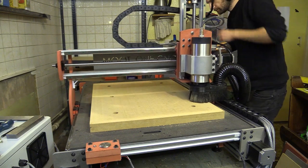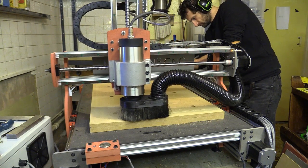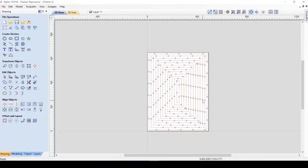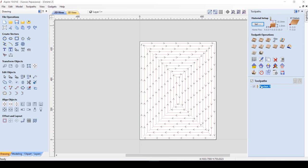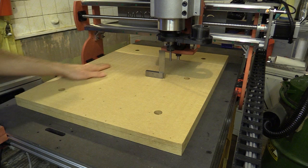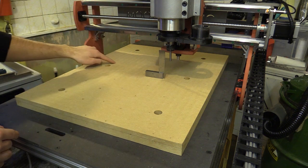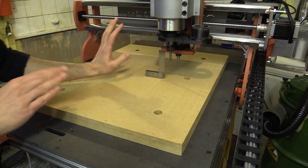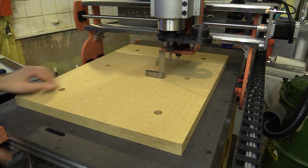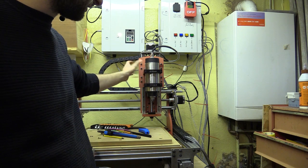I'm really happy with this, and the last thing I need to do is resurface or flatten the wasteboard. I do this with a 22mm two-flute flat bit cutting 0.5mm into the wasteboard. The tool stepover is set to 85%, which is roughly 19mm, and the feed rate is 1800mm a minute. I use a conventional offset toolpath which means the tool spirals and includes movements across and along the wasteboard. The advantage of this method is that if the spindle and its tool are still not entirely square I'll be able to see signs of this on the wasteboard. It's barely noticeable, but if I run my fingers across the wasteboard and look carefully from a particular angle I can tell that the spindle is off by a tiny fraction of a degree counter-clockwise along the X axis, and there's a nod present along the Y at a similar amount. In the manual I'm writing for this machine I use a different spindle mount, which you can see over here — it's not as clunky, and I think it'll be easy to get that final calibration down, possibly shimming the spindle itself around 0.2 or 0.3mm.